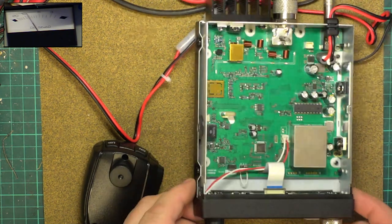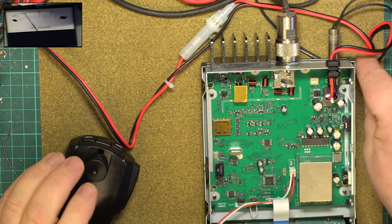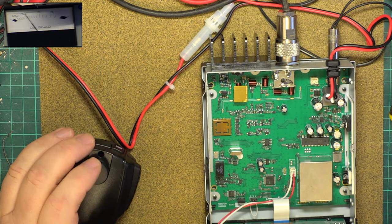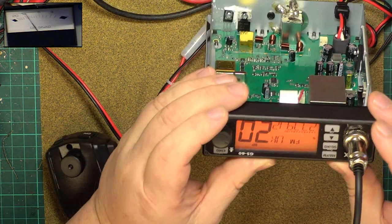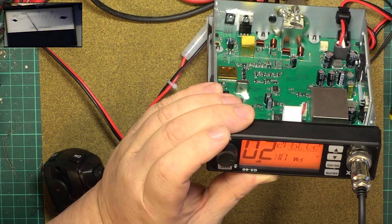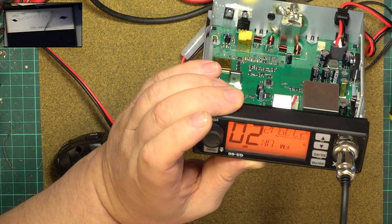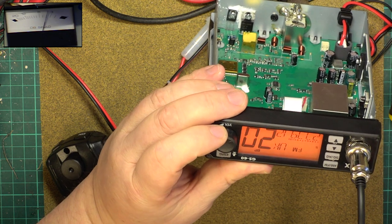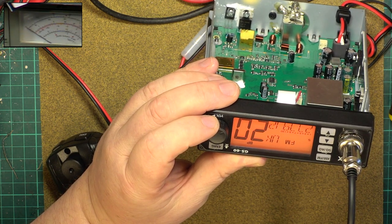I'm not going to start looking for CTCSS and things like that. It's not what I do here. But we've got 4 watts out of it, and we've done the deviation, and it's on frequency. So, let's see how that squelch performs. So we'll park the signal generator at 0.3 of a microvolt and switch it off. And I'll turn the volume down, and I'll move this camera down to those controls where we erroneously started off with.